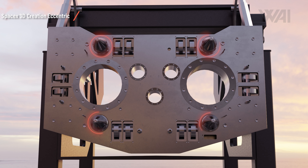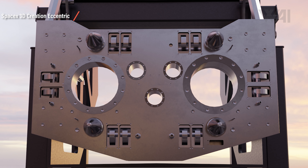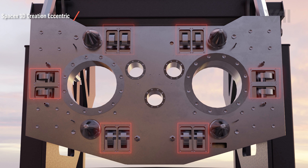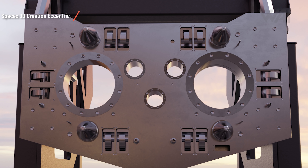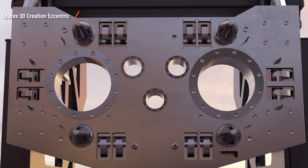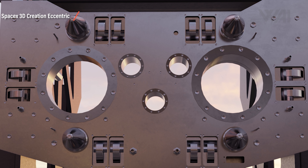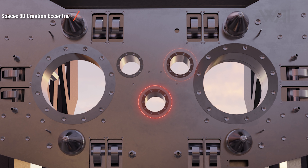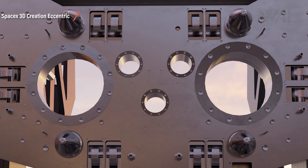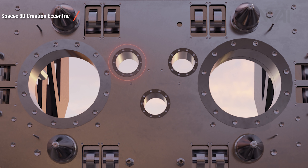We also have locking hooks — as soon as the alignment pins are pressed in all the way, these hooks snap into place, preventing the QD arm from moving at all. The two large holes in the middle are where the main fuel lines for liquid oxygen and methane connect, responsible for filling up the main tanks quickly to reduce boil-off before launch. On the bottom is a Fuel Bleed line — a backflow line preventing overpressure inside the tanks. In the top right is LOX pressurization and on the left CH4 pressurization. Those are likely for nitrogen, pumped into the main tanks to pressurize them and give hull integrity to the booster.